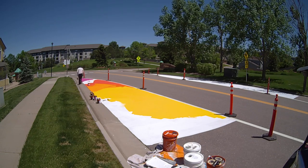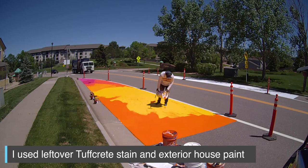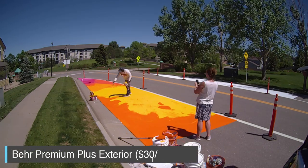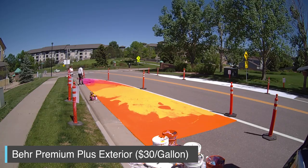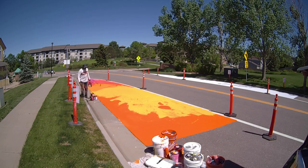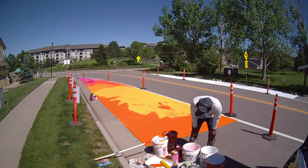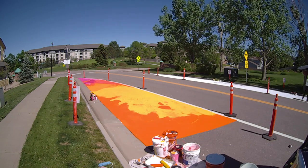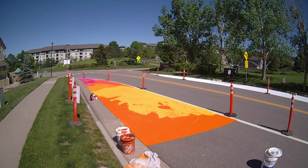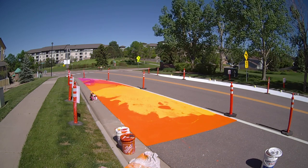Adding that white primer really helped out a lot. The paint I used was the Tuff Crete stain as well as regular exterior house paint — the Behr Premium Plus exterior paint — because this surface is going to get hit by the sun a lot. One good thing about painting on this horizontal surface was that everything dried super fast. I think it was in the 90s when I was painting, super hot and sunny, and we're at high elevation, so it dried really fast. I was able to paint and then maybe 10 minutes later step on it to get to the next area. And if the weather changes, I'm not super worried about rain washing the paint away because it just dries so fast.